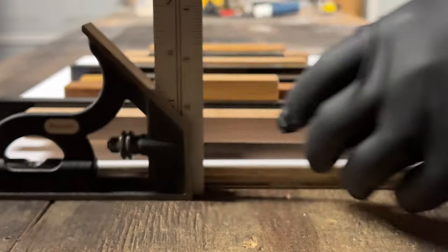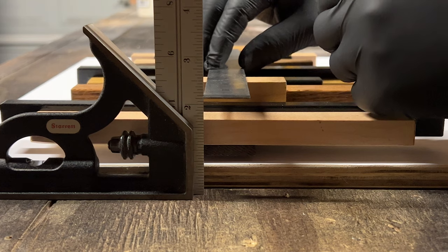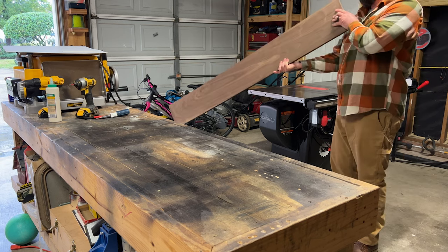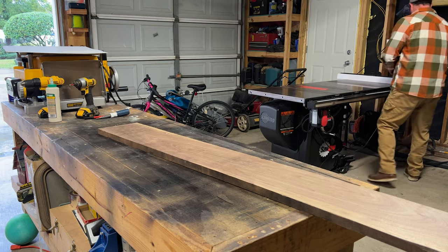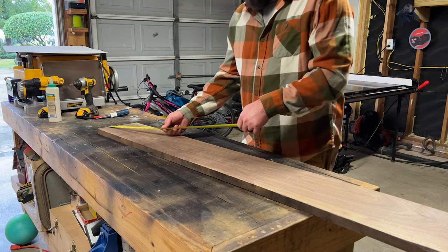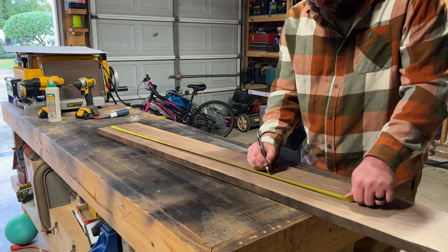I laid the waveform on top of the board to understand how tall it was going to sit off the board, and it came out to about 2 and 1/8 inch. Since it's a shadow box, I wanted the frame to be a little bit deeper so there'd be a space there. I took this piece of 5-quarter walnut that I got from West Vice Hardwood — not a sponsor, but a great hardwood supplier here in the Southeast Texas area.